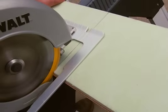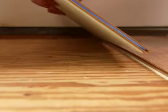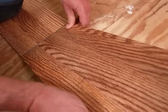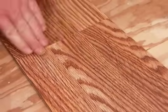in length. To cut the flooring, place the plank on its face to reduce chipping, and use a saw blade recommended for flooring. Insert the tongue of the long side of row 2 into the groove of row 1. Use a slight angle and press downward until the joint locks. Then attach the next piece of row 1. Join the tongue and groove of the short side at an angle and press down.